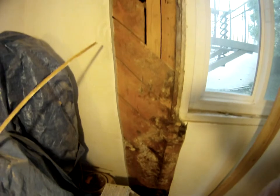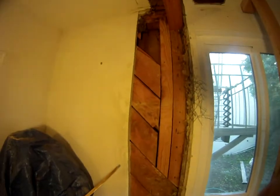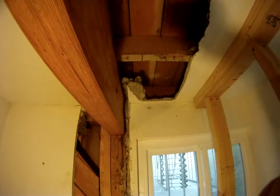Clearly water has been running down the inside of the wall — you can see the water staining and some of the fungus growth in the wall here. Water was getting behind the stucco and getting trapped in here, either coming from the failure of the deck up above or the actual stucco wall itself.